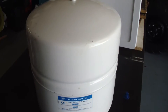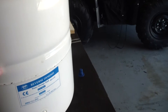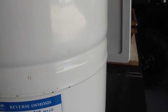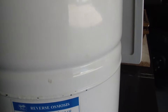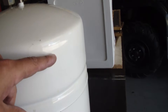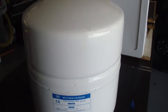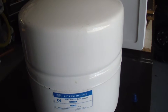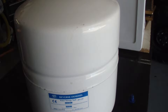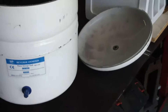I'm just going to get it done and come back and we'll take a look inside. I'm assuming this little indentation right here is probably where the diaphragm is retained, so I'm going to try to cut somewhere in this area, up closer to the top — maybe about half an inch from the transition. I'm just going to take a cutoff wheel, go all the way around it, get it cut off, and we'll see what's inside the storage tank and how clean it is.